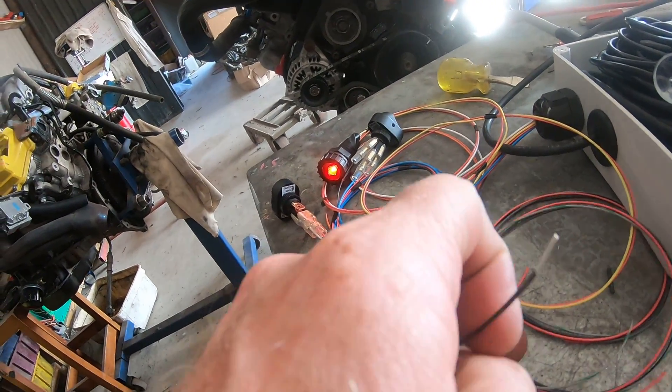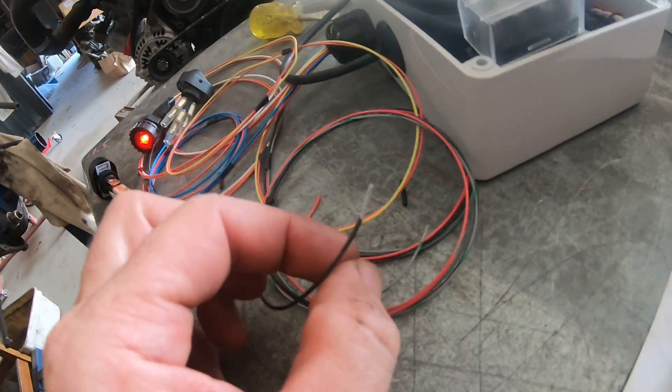I've got these wires that switch the fuel tanks. This boat has dual fuel tanks, each with their own EFI pump. There's going to be a little switch on the dash — which I forgot to order — but it now enables you not only to switch the solenoid, which ensures the fuel return goes back correctly to the right tank, but it also switches the fuel pump operation as well. I tried a little bit of trickery and it did work — I'm really happy about that.